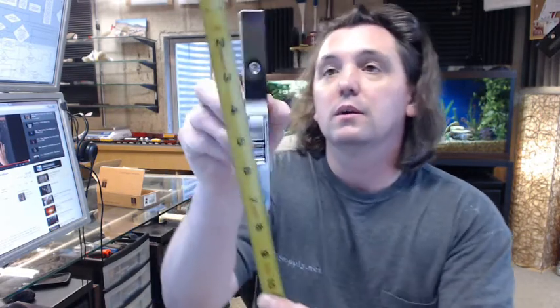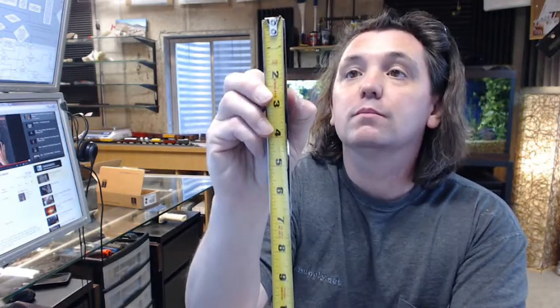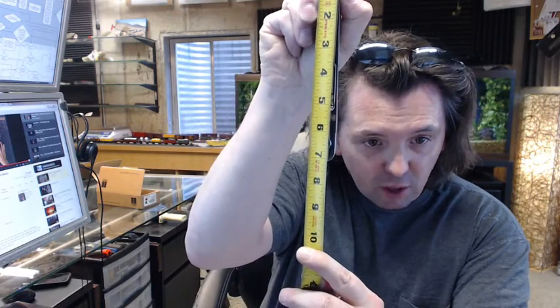The template is calling out a 7 and 5/64th inch mortise in the edge of the door, so that would put this bolt at basically 7 and 5/64ths — essentially 7 and a 16th of an inch is what it comes out to, as 5/64ths is pretty close to a 16th of an inch.